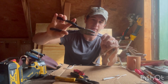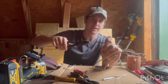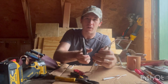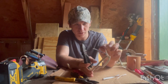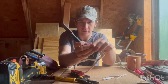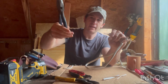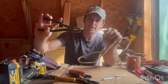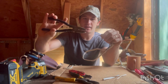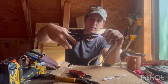And then you give it a little extra twist so that it starts twisting down into the insulation. It's not necessary to twist it all the way down the insulation unless you're just a super electrician or an overzealous homeowner. But you definitely do want to make sure that it's tight. So remember, you've got 2 wires coming together, you're holding them steady. Can you see that? You grab it with this, nice and easy, just nice and easy. And twist.